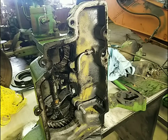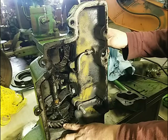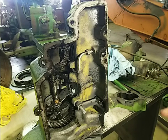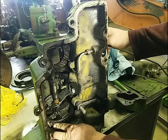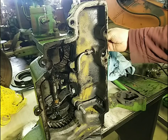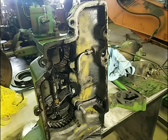So we've talked about the fan shaft being really loose in the tractor. You know how a light bulb kind of goes off in your head after the fact — we got to thinking about it. All of this is connected to the cam gear of the tractor, and it runs off the idler gear. The idler gear was the one that was really loose, plus the looseness of the cam gear. When we were moving the fan, we were taking all the slack out of those gears that were extremely loose, and with the couplers being loose on the fan shaft also, all that magnified and made the fan really loose. So, in theory, if you think you have a problem in the governor housing, go to the fan and rock the fan back and forth. If it goes an extreme amount back and forth, you better pull the governor housing off and check.